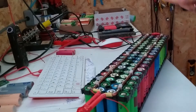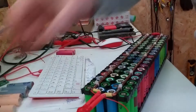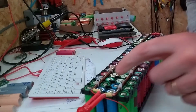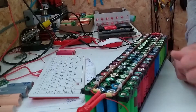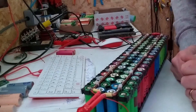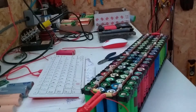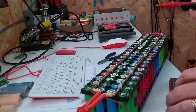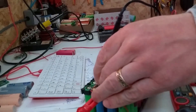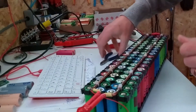These fuses are so small that it's actually quite hard to see. Actually, this one is separated — which might explain why we got a bit lower capacity in the first place, because that will be a whole 2,000 milliamp hours or so less for the pack since this one is not connected. Let's just check the voltage on that one. Yeah, I think it's probably just snapped through. That's the same voltage as everything else.